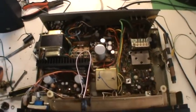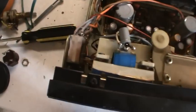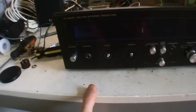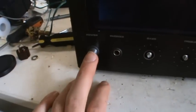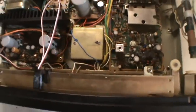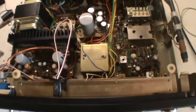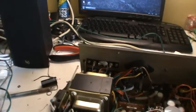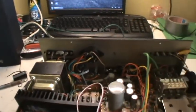If you take a look inside, you can see I did some modifications. I threw in a relay which turns the speakers on and off, because they were originally switched by the power switch which was also broken, but my replacement didn't have that extra switch. I also replaced all the dial lamps with LEDs because all the original bulbs were burned out. That's why I got it so cheap — the shop owner didn't know it was actually working. Nothing happened when he plugged it in because there were no speakers hooked up.